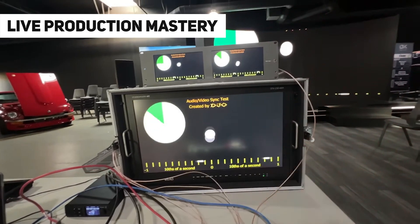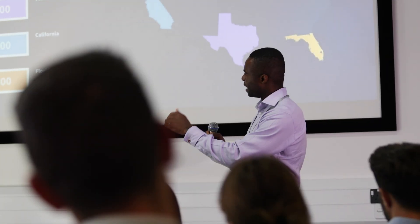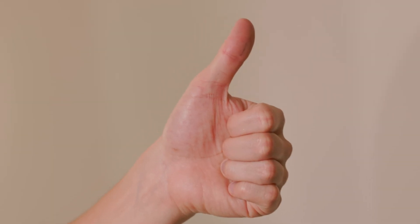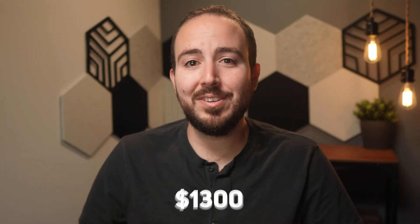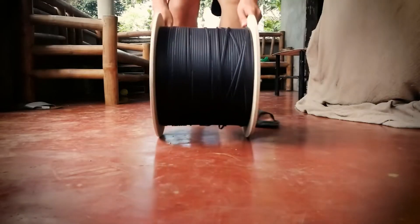So this begs the question: what's the delay? Shoutout to Brandon and his channel Live Production Mastery — he did a test with an LED wall and saw maybe 2 or 3 frames of delay. I'll have to do a real delay test in a different video, but for now it's worth noting this is a great solution for more static signals like PowerPoint slides or a multi-view where frame-by-frame sync isn't as crucial. The fact that we can use one single CAT7 cable to make all of this happen is a big money saver — the 3x3G boxes are under $600 and CAT7 cables are around $25 per 100 feet. If you were trying to send six signals over fiber optic with all of the converters, you certainly wouldn't be spending under $1,300 for the full kit.